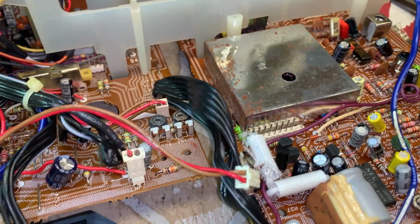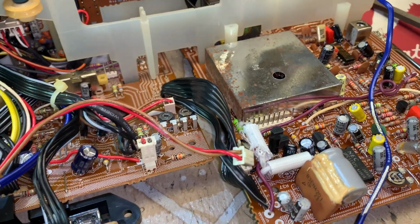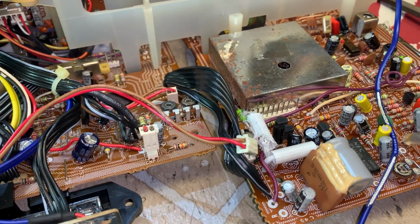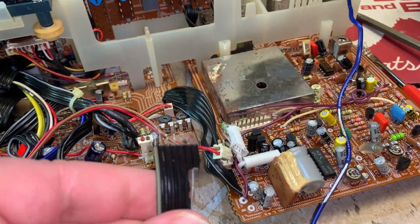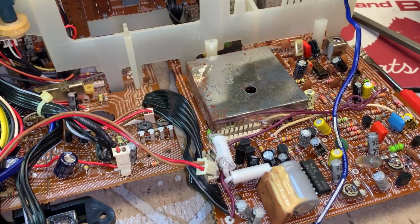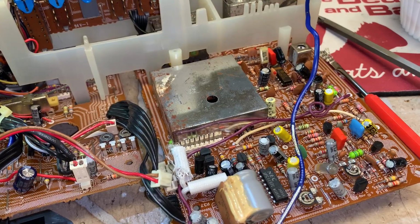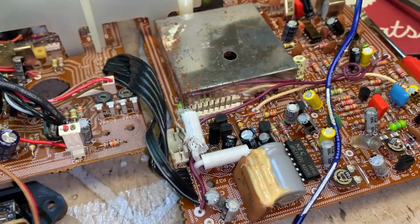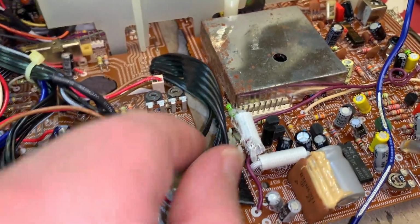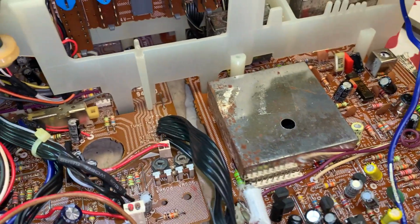This came out of the parts unit GE 3-6035 that I demonstrated in a previous video, link in the upper right. Now, the only difference is this is a 7 conductor ribbon cable, and the max that thing had is only 6. So I chose another ribbon cable that had 5 conductors, and then cut another one that had 2. But if you didn't know I did that, you'd think this would be the original ribbon cable here. But yeah, these two at the bottom are separated out because I didn't have a 7 conductor cable.